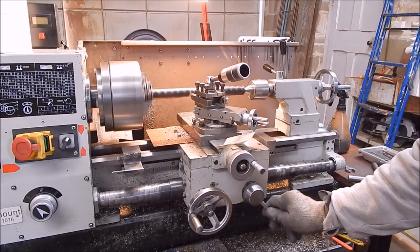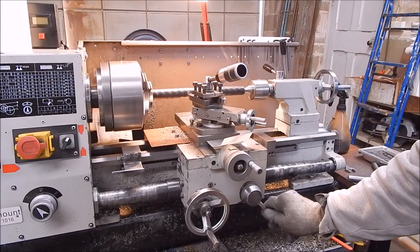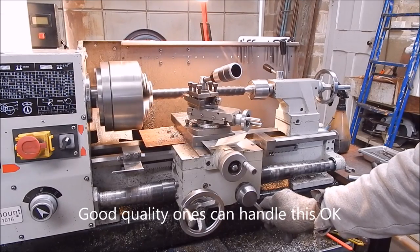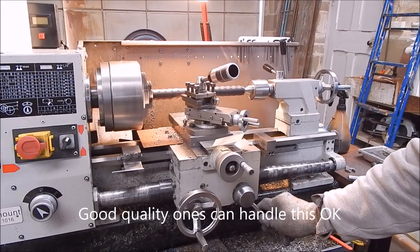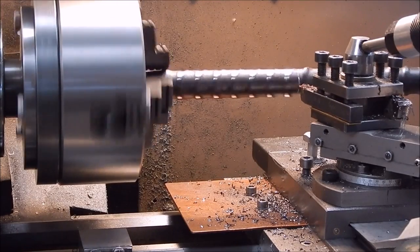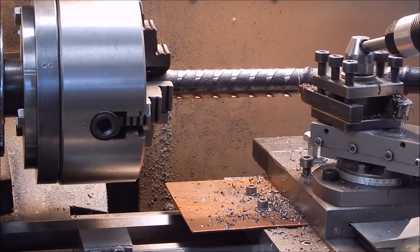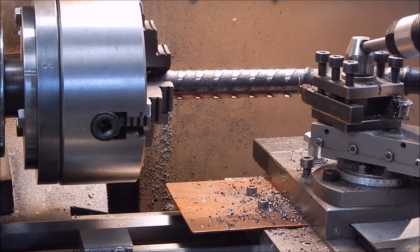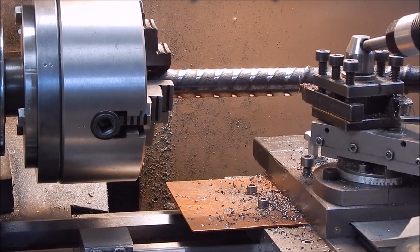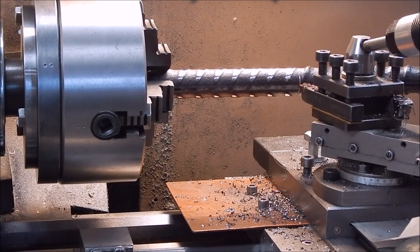We won't go in too deep for a rough surface — don't want to go chipping the CCMT cutters. We're just using carbide on this, do it dry, keep the heat up. As this is a pretty irregular surface, I'm going to dampen down the cross slide with the cross slide lock, just put it on enough that it will take any vibration out. Cross slide locks are great, simple to fit — there's a video on my channel showing how to do it — and that will stop a lot of any shudder you get from this sort of job.